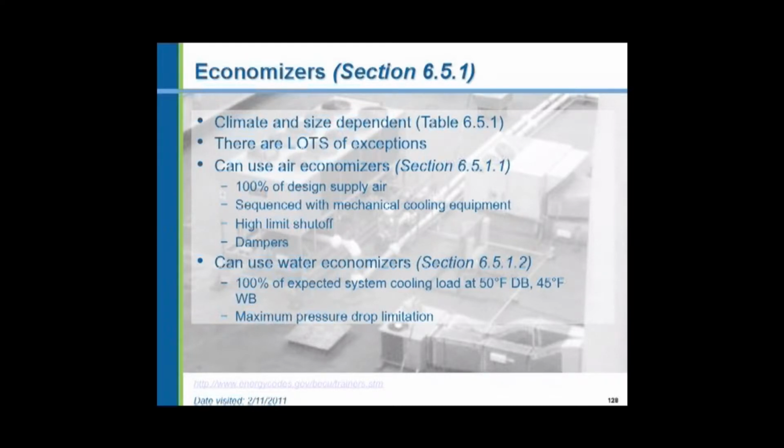Now, over the years, as a rule of thumb, engineers have come to utilize 55-degree supply air temperature to maintain a 75-degree air space temperature in the cooling season. Just a rule of thumb. You can put colder air in, less volumes, but it takes less air. You have to worry about cold drafts and things like that. But over the many decades, 55-degree air yields a 75-degree environment. So if it's 55 degrees outside, why not bring in full outside air, shut off the chillers and the condensers, and cool the building with that air? That's what's called an economizer.